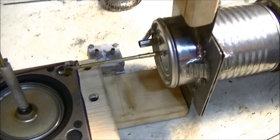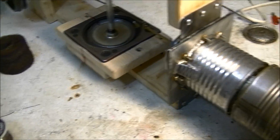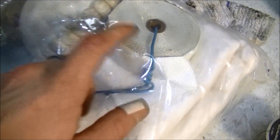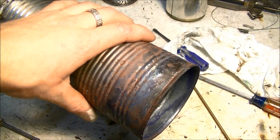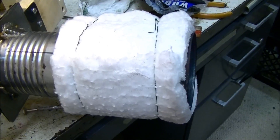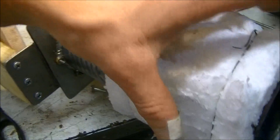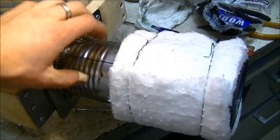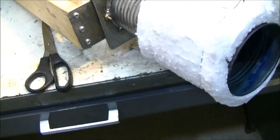Now I'm putting it back together — just gotta hook up the tubes and get it all set up. The displacer is all put back together. I'm also going to put some strap insulation around the hot side here just to insulate it so it doesn't lose so much heat. I've got the insulation around there now, so it shouldn't radiate so much heat off of here or up into the cooling jacket. Let's go hook it up and give it a run.